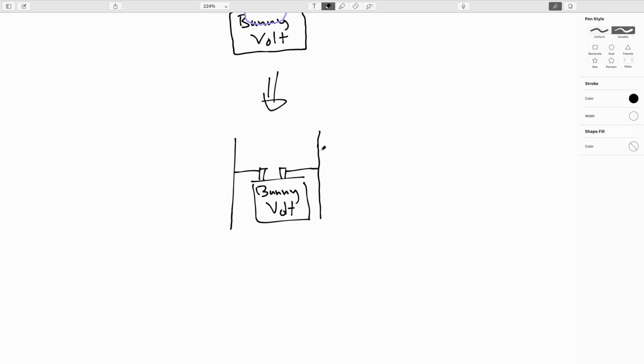So somehow we've really shrunk our battery down and now it's within the plate. But again, it's going to be the same idea. So we'll say this is my positive terminal here, that's my negative terminal there. So as the battery moves my electrons, we're going to build up positive charge and negative charge. What's going to happen is the electric field is going to get ever stronger, which means that each subsequent electron that you move, you'll have to work harder.